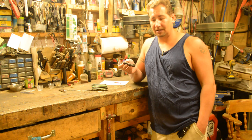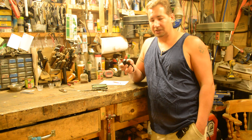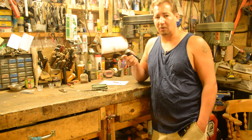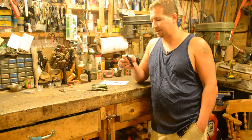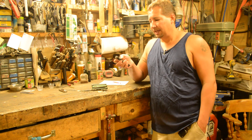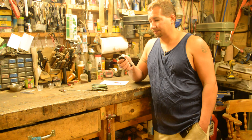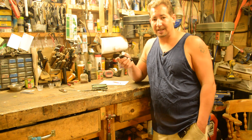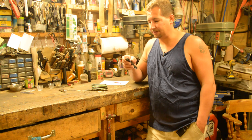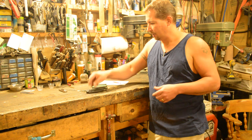I stripped it down, took a look at it, stripped down one of my 940s, and decided to go ahead and make one myself. I've been wanting to make one for quite a while, but a couple things were stopping me. First was the springs — they use omega springs and I've never seen a place where you can purchase those, so I grabbed some spring wire, made a jig, and bent up my own springs.